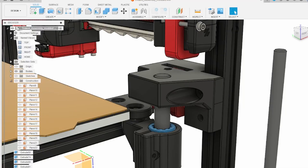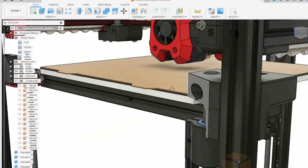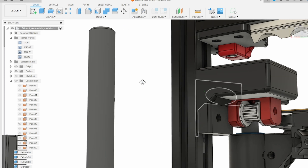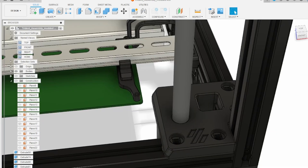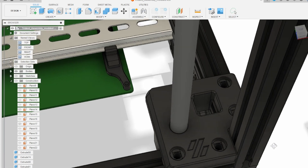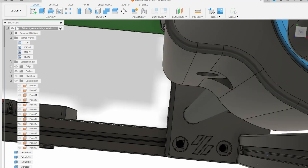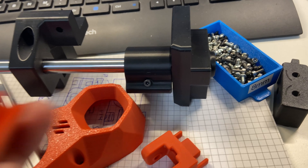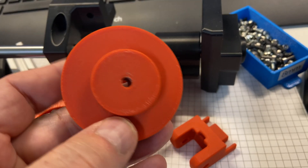You'll find the complete CAD model on Voron Designs' pages, and I almost feel bad messing up these wonderful designs. The challenge in my build is that I want to use 12mm rods and bearings instead of MGN rails for the Z. The Y-axis will use MGN 12H because I have them. It's a bit tricky to get room for the belted Z, but I think I'll figure it out.